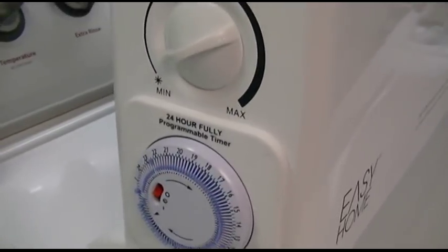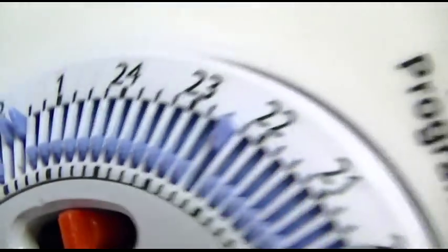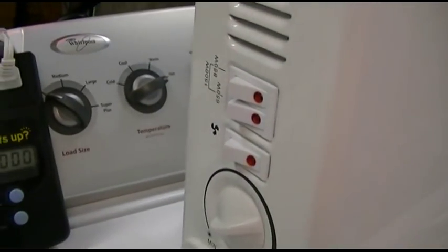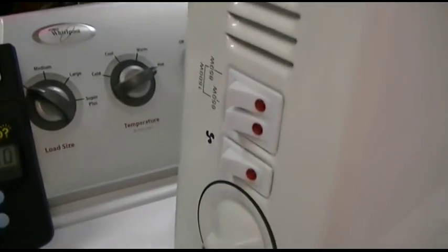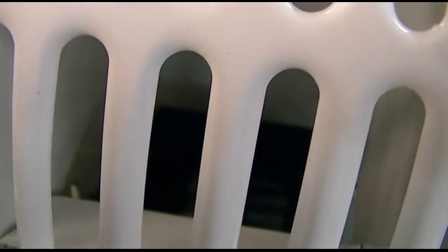The timer does run all of the time. I'm going to put the camera microphone on it so you can hear it. But you'll see it does not register on the wattmeter. We'll go ahead and energize all the different things. You can actually do just the fan by itself — I'll turn the thermostat up. Kick on just the fan — that uses 13 watts. There it is inside running. It actually takes quite a fair bit of time for it to come to a complete halt as it slows down.